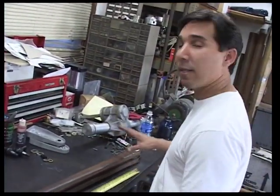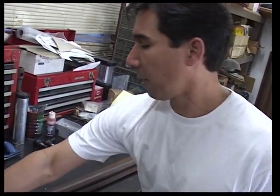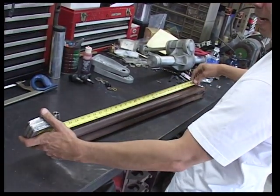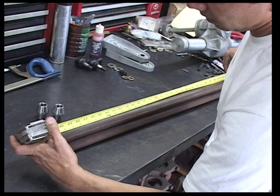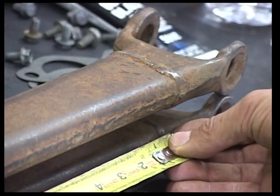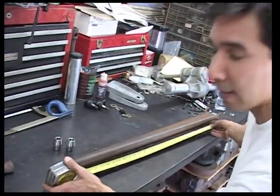What I'm going to do is take a tape measure and see how good of a job we did here. We stayed very close to the weldments, like we said. I'm going to go from the perch weld to the end of the axle and take a measurement — that is 30 and about 9/16ths. And I'm going to measure the bottom one just in case we have to do some extra cutting. And we have 30 and 9/16ths. If you look at the ends, it wasn't a bad cut — both very close, within a 16th of an inch.